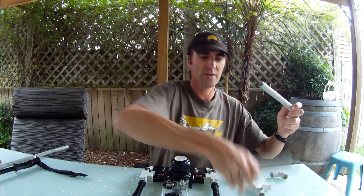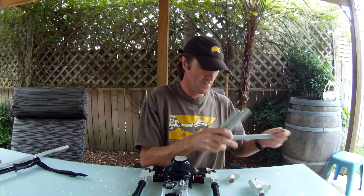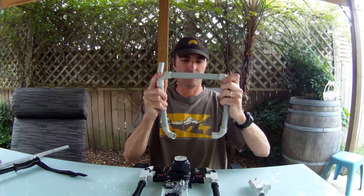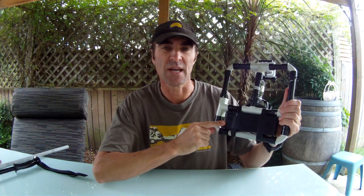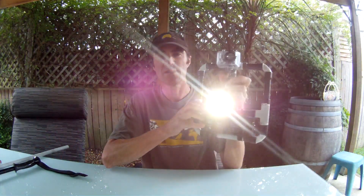Once you've done that, it's simply a matter of putting pieces together like Meccano to make the shape that you want. I have used the four conduit corners and four T-junctions. I made this space big enough to fit a 12 volt sealed lead acid battery. In the front we have a 10 watt LED downlight globe and a switch to turn it on when you want it. And as you can see, it's quite bright.